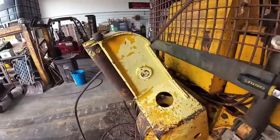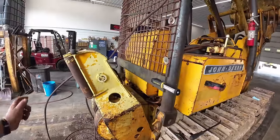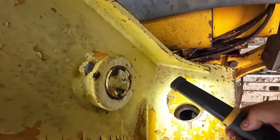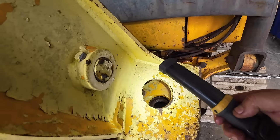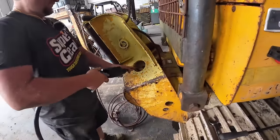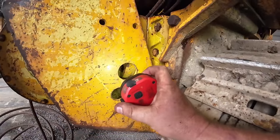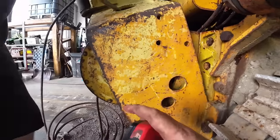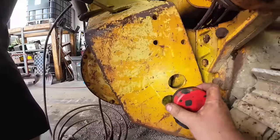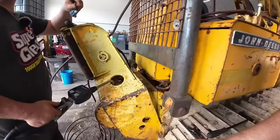I don't think we're getting enough oil. There's a little hydraulic pump in there. You guys have seen us work on some of those other winches. There's a video coming out of us fixing a problem like that on a newer winch, but yeah, it's got oil in there, so I don't know. You gonna top her off there, bud? Until she runs out the hole down here. I'm guessing with all that cable out, they probably quit at some point. Oh, yeah, you're full. That's not the problem.